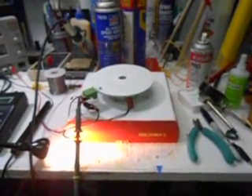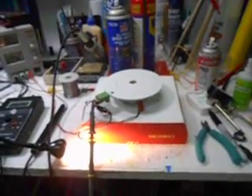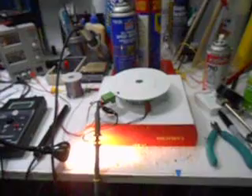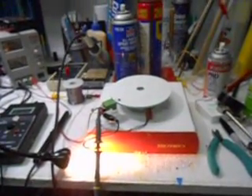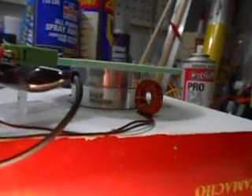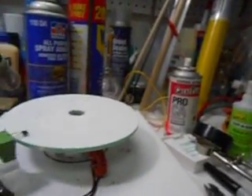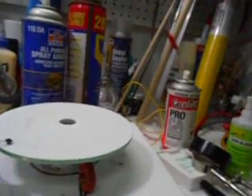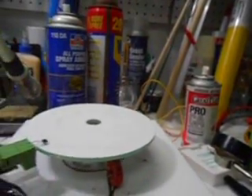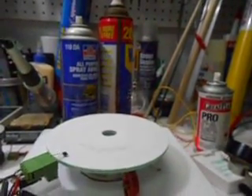There are lots of interesting attributes and many things you can do with it. I've been playing with it for a couple of years and haven't said much about it except to a couple of friends. I thought I'd discovered something else the other day and got really excited, but it was not true — I thought I could come up with a null field device, but it did not work. Anyway, this device right now has a huge gap in it; I'm not trying to do anything but show that it runs. If you close that gap, this thing will easily spin up to about 2,500 RPM on that one coil. But because everything is unbalanced — the wheel is unbalanced, the forces are unbalanced with only one magnet — it'll vibrate and buzz like heck. But this is just a demonstration to show you a switched field device.